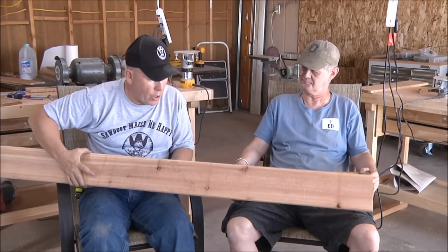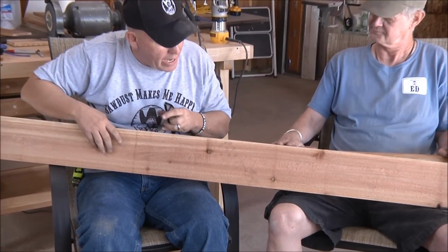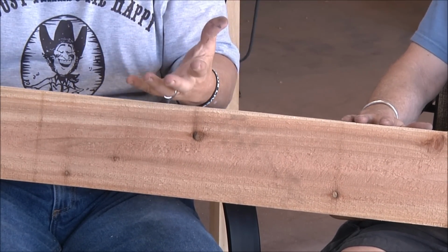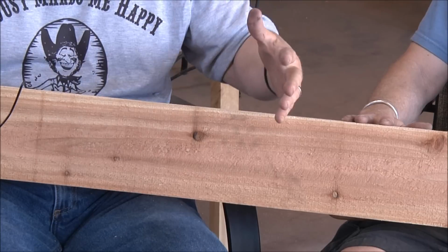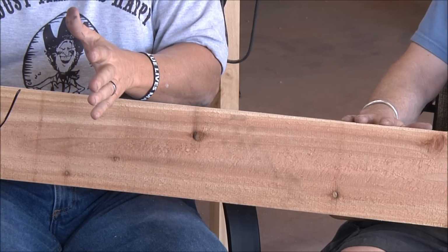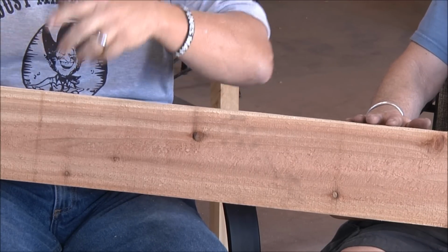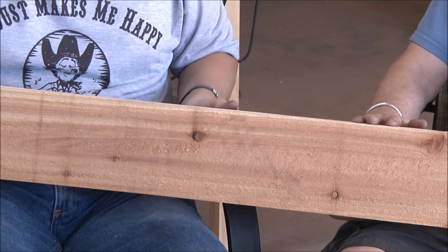So when I pick a board, let me use your leg there. Sure. I've started to integrate knots more in my signs because they look so cool, but traditionally I like to stay away from knots simply because they're unpredictable. You never know when you're going to carve through a knot. I've had one look solid, and when you get halfway through carving it, boom, it busts loose and half your letter is gone. In fact, I had that happen not that long ago.